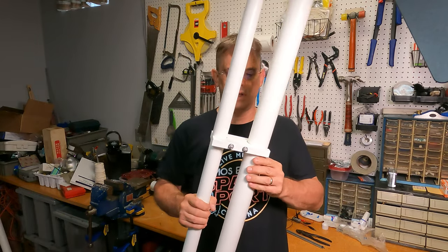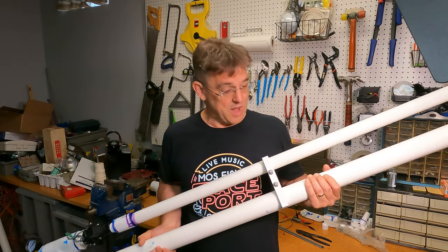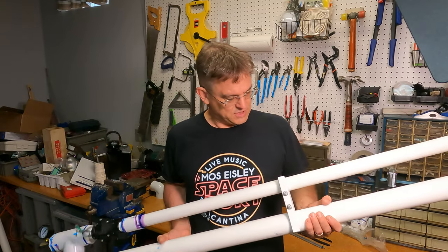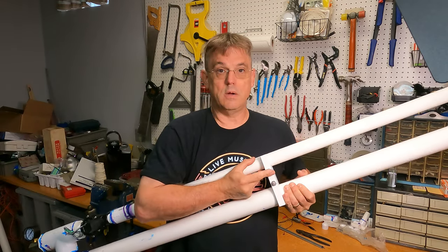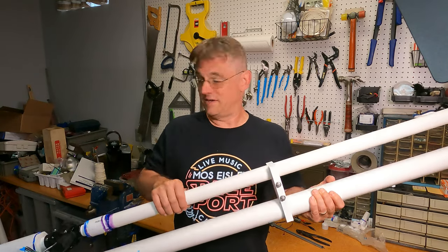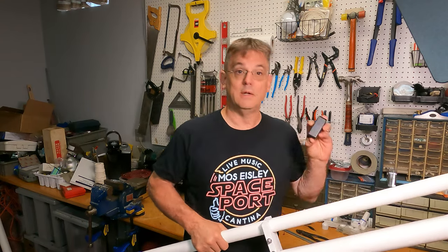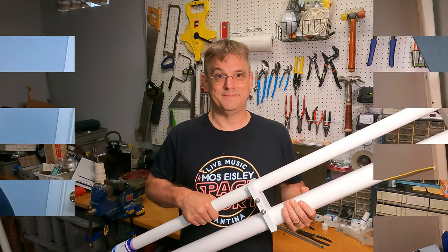Thought I'd mention that the clamps I came up with to keep the barrels separated and stable actually worked really well. Last minute decision here to actually split this clamp I made down the middle and leave a gap in there intentionally. And then I just passed some 1/4-20 bolts through there with shake proof nuts and washers on there. So now it's actually super solid. It's not coming apart. It's not going to rattle when you fire it. And it just feels mechanically solid. Looks good. So let's get to building this little firing circuit, and we'll put it on there and see how it works.